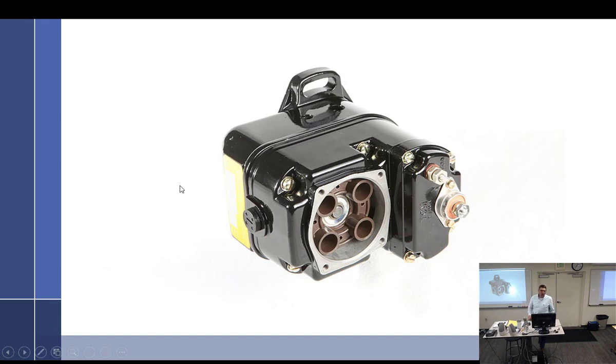Now we are getting into retrofitting electronic ignition into our aircraft. There are many, Surefly I think is one of the more popular ones. There are a couple of different companies where you can take off one of these magnetos and put an electronic one on, but you need battery to operate that. So you need an alternator that runs in the battery that works and all that stuff.